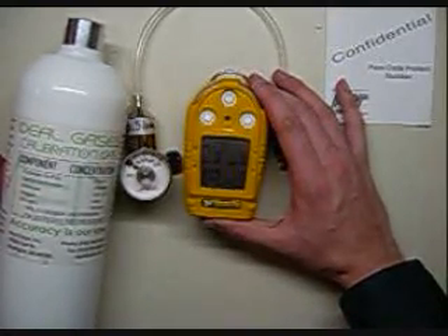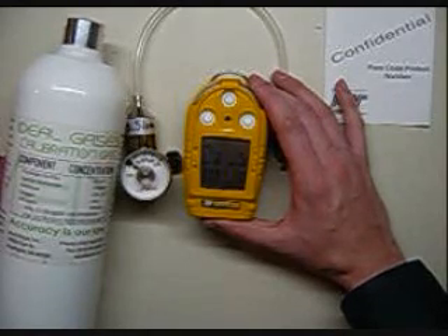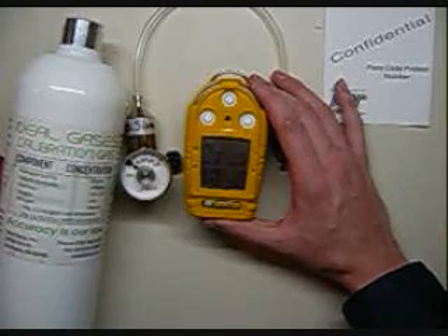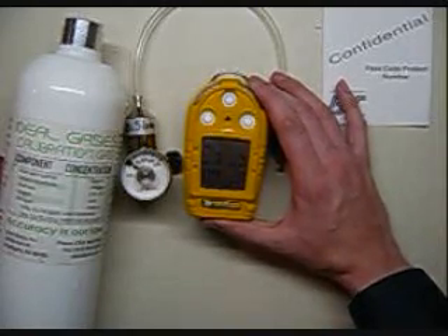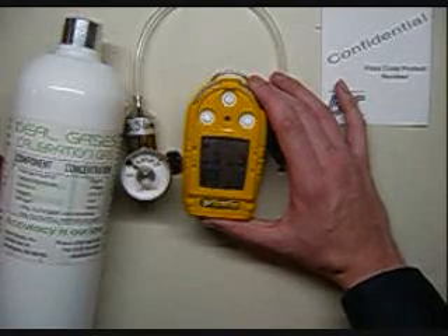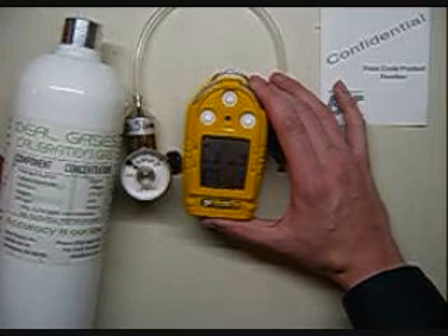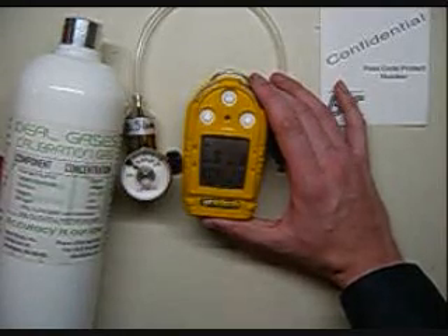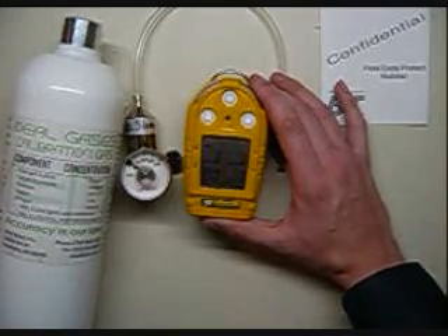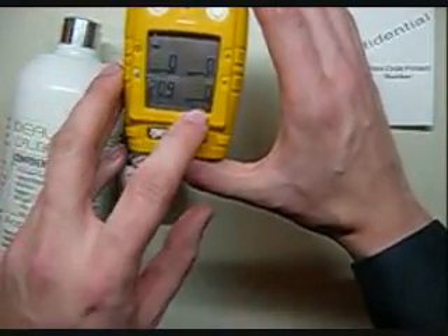Okay, we're almost back down to zero now. I have heard the myth that if you turn off a gas monitor while there's still gas in it, it will upset your values — again, that's just a myth. You can turn it off at any time. I like to make sure it goes down to zero just to make sure I'm happy with the monitor. But if you turn it off, it's not going to cause any problems. The only thing you will run into occasionally is if there's some gas lingering in there and you turn it off and then immediately turn it back on, it'll occasionally auto-zero on startup — and you don't want it to accept those values as your zero point. But as you can tell, we're down to zero, zero, 20.9, and zero.